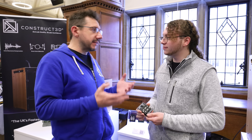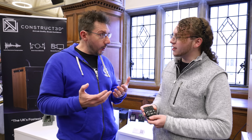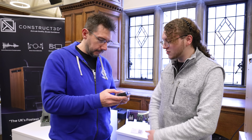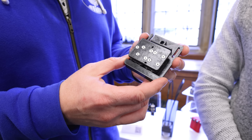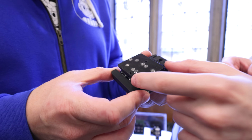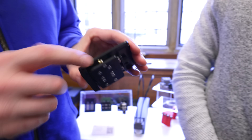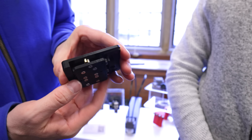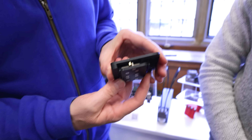I know that we're always worried about the weight of a head in a 3D printer, especially when printing at speed. So does adding a secondary rail add much weight? Not as much as you think. So that is the first iteration of the reverse TAP plate. Two rails. And instead of it moving up to hit a button, as soon as it moves, it breaks a circuit. So if you see on the side, there's a bolt and just an insert. As soon as they separate, the circuit's broken.